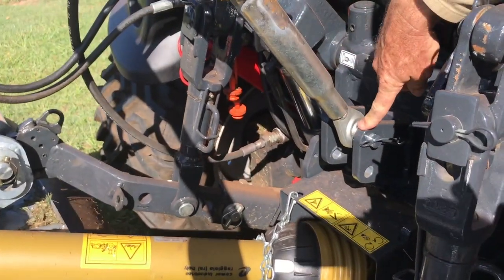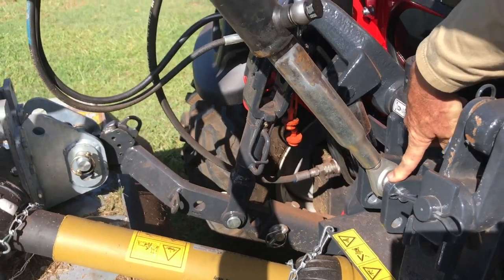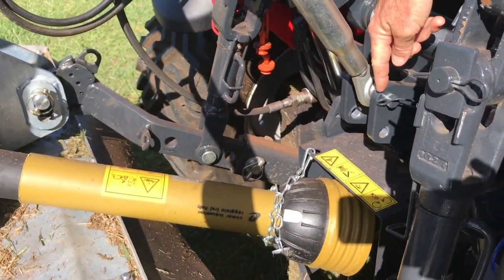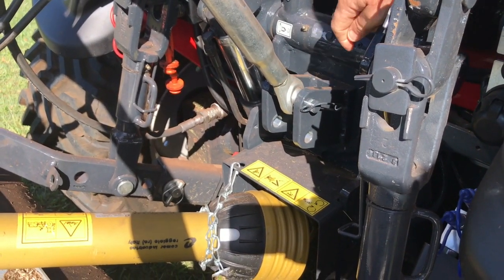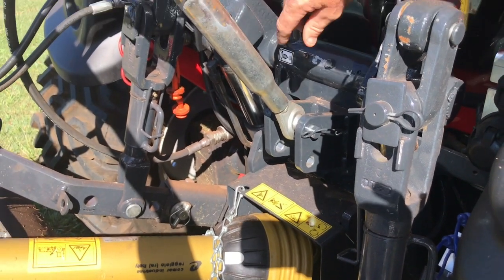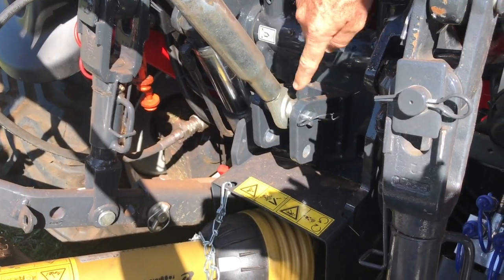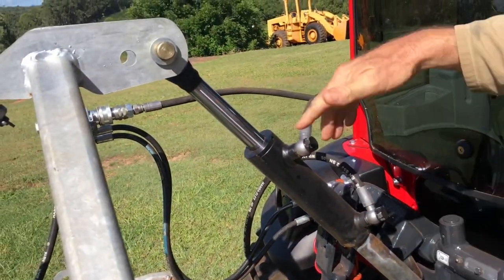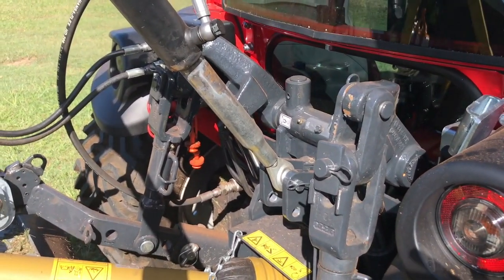You notice this tractor doesn't have the Carraro draft position option, and therefore it's got this fabricated steel top link, not the cast one, because the cast one has a different geometry about it. The pins are further out and that would sort of stuff things up a bit. And we're using the top pin position, so that's important. Top pin position there, the rear position there, and of course the lengths that I mentioned in the video yesterday.